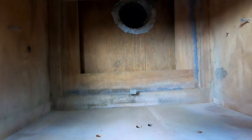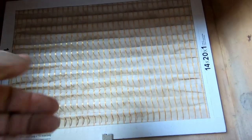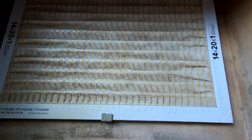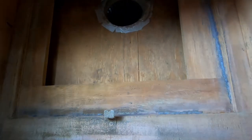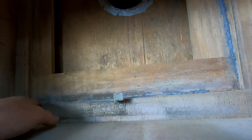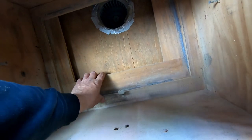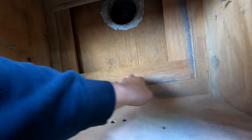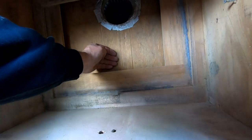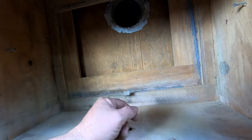I'll put my filter in here — I've got a 14 by 20 filter, but you could make this whatever size you want. I cut a couple pieces of trim material and screwed them in to hold that filter in place. I also came back and put a little frame in here to create just a little extra depth. If I had to build this all over again, I'd use the same cutout but have it much lower, have my fan a lot lower, and have a little more depth so it can collect more air in that volume of space. Other than that, this thing's been great.